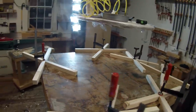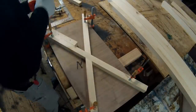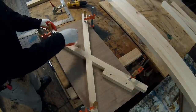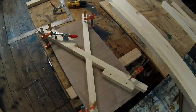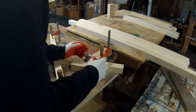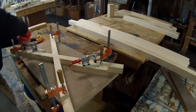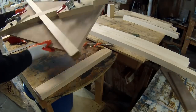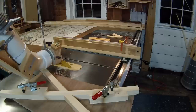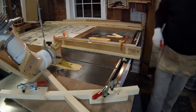Here they are all glued up — four small X's and two larger X's at different angles. All of these X's are oversized. Here's the template: I'm using a piece of MDF to screw blocks onto as a template. The blocks allow the X to line up in the same position, and I have it marked with a pencil exactly where it is, centered on the piece. I'm attaching toggle clamps to make clamping go faster. That template jig took maybe 10 minutes to build, but MDF probably wasn't the ideal substrate because there's a lot of friction on the edge.